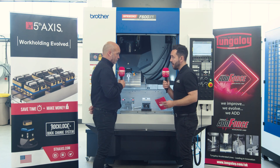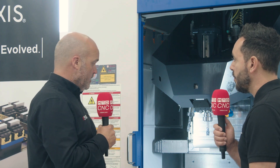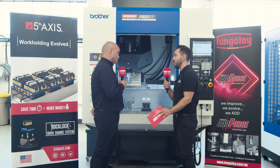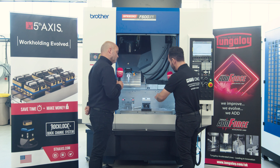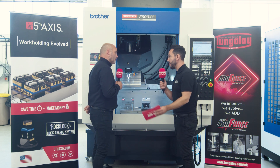And once you've got this zero-point plate, I assume it just saves setup time ultimately? Yes, setup times are always a bit of a problem in the machine shop — it costs time and money. A zero-point system on here, you can take on and off your products and it'll repeat within eight microns every time. When looking at three-axis machine tool work, setup time reduction is paramount. You need to keep that spindle turning, especially when you've got a Brother. Now, looking at the vice — the centric gripper — talk us through this vice and why you've chosen it for this application.